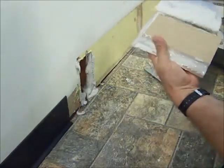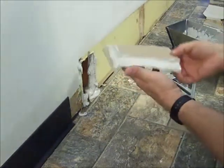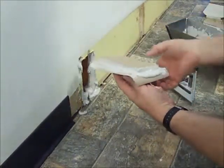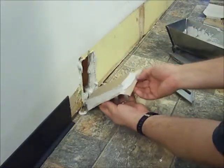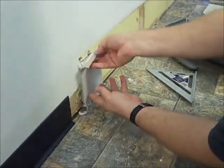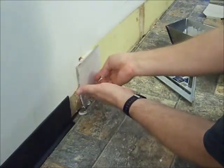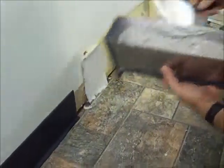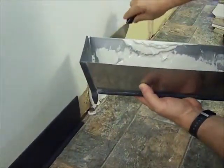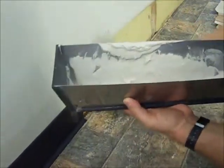I actually make these patches just a little bit big and a little bit sloppy. The actual patch is a little bit small, so it fits a little sloppy inside the hole. I like to have that extra eighth of an inch around the edges to play with. And that seems to make it bond really nicely inside the hole.